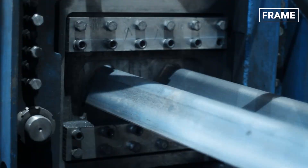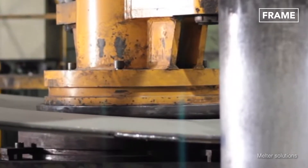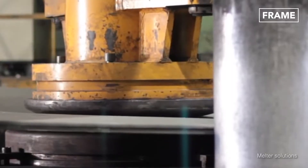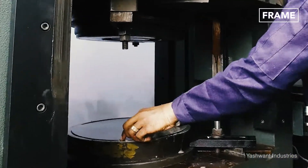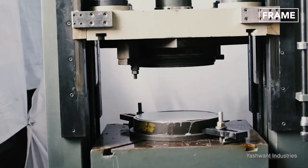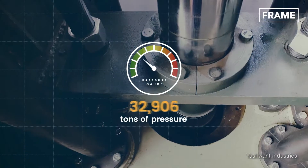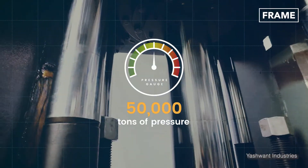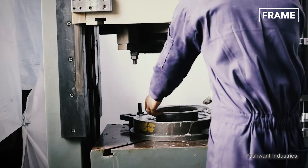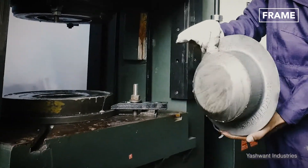Here, you see a single action configuration with one hydraulic press applying pressure to a piece of sheeting. On the other side of the press is a stationary platform to provide resistance. In a dual action hydraulic process like the one here, you see parts being compressed between two hydraulic pistons. Known as drawing machines, these presses can apply over 50,000 tons of pressure over an incredibly small area to induce deformation. This produces a very hard and dense finished product, typically with an impressive strength to weight ratio.